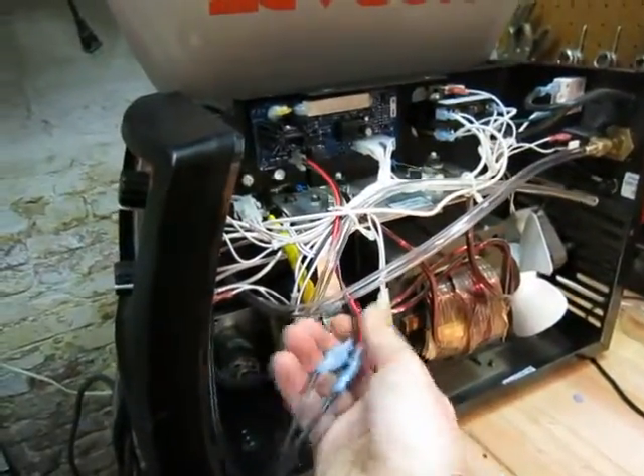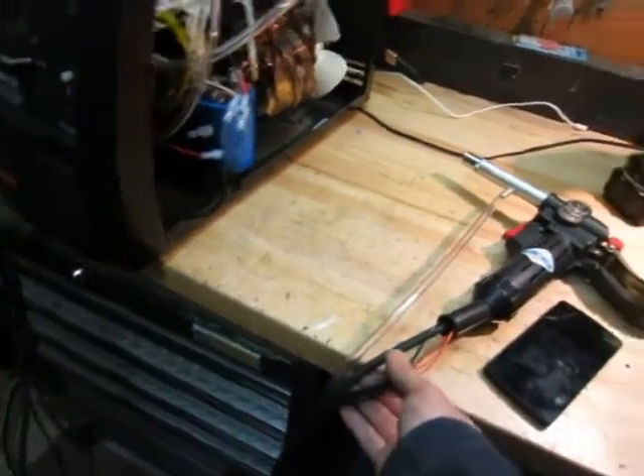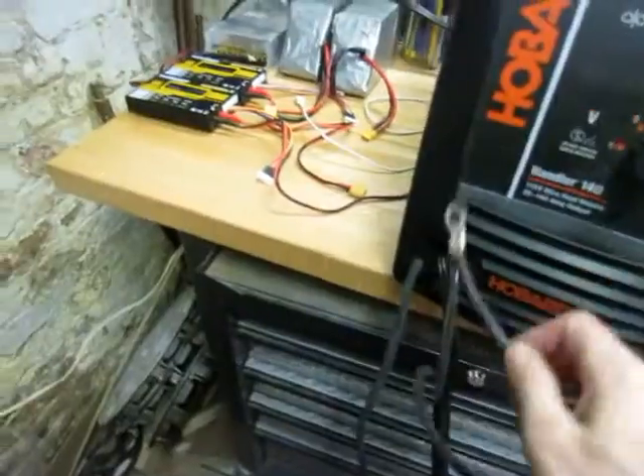So now I have my motor power and my trigger plugged in. When we pull this trigger, the motor will spin and we have the shielding gas. The other connection is the big welding wire that goes through here and attaches — there's usually a little short cable that attaches this to the unit, so that just goes in there.